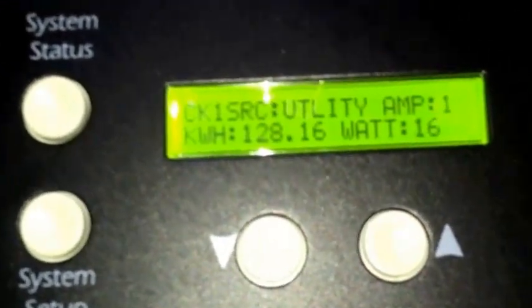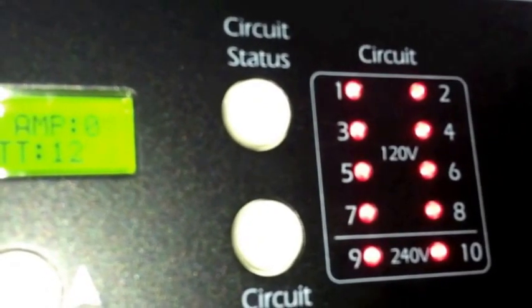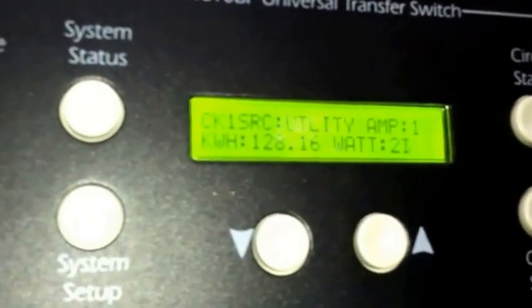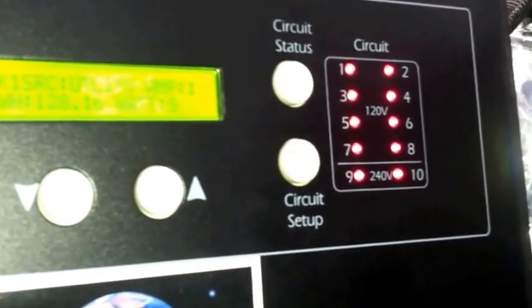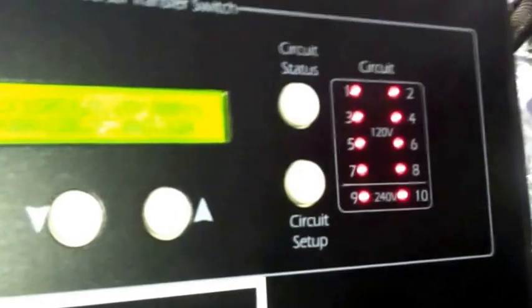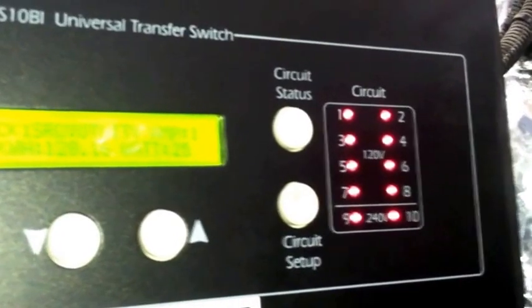This has about 10 circuits. Two through eight are on the battery backup on the Outback. One, nine, and ten come on with the generator, so I'm also going to do the generator test because I haven't started that in a while. I'll walk around the house and show you everything that I have on. First I'll show you the Outback's control, and then the three circuits which I believe are just strictly for the kitchen, because that uses the higher amount of power. I believe one, nine, and ten are for the kitchen. I didn't get a chance to label this yet, and I rewired it all. So we'll walk around the house and we'll see what the Outback's controlling, and then I'll kick on the generator and see what's left.